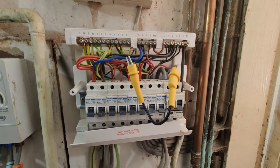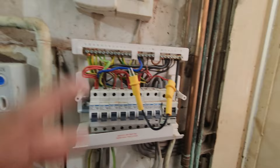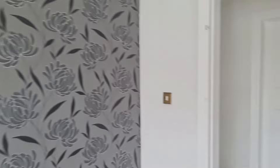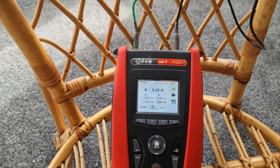Let's go and get these values for the lighting circuit R1/R2, then move through the rest of them. We've got the TIS set up in TN mode. Continuity meter is all set up. We're running up into the Lightmate adapter going into the flex drop from the ceiling rose, and then onto the CPC terminal within that ceiling rose. We've got the light switch in the on position. Hitting the test button we should get a value of impedance and continuity between that line and CPC. It's measuring 3.19 ohms, which is a little bit higher than I would anticipate - it's only a relatively short circuit serving three or four lights. That is a red flag to me.